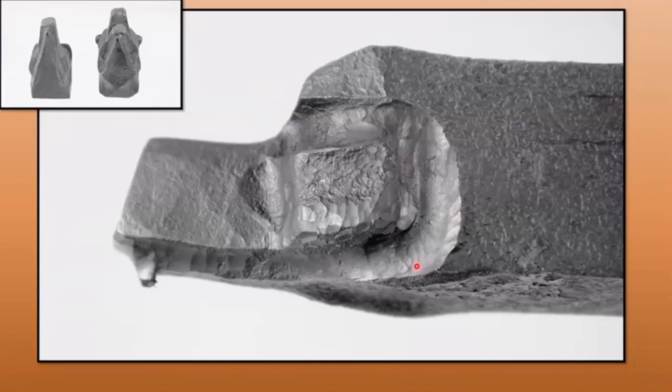Same on his cheek. And I've come along with my fuller and I've just bounced the fuller on and off that. Again, at a black heat, doesn't have to be a black heat. And I'm just trying to give this a little bit of texture and get rid of the sharp line that you can see here on the bottom of the jaw that existed on the cheek. All I've done is try to blend that in and give myself just a little bit more texture than I ordinarily would have had.